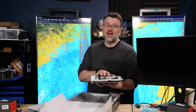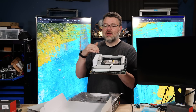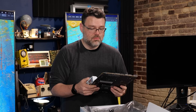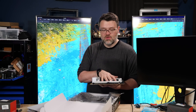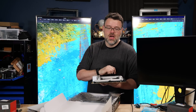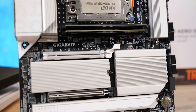For the 16 plus 8 plus 4, 105-amp power stages, we have three giant heat sinks all connected with a heat pipe in a U-shape, with a see-through sandwich design meant for airflow. I don't think you should be dumping a thousand watts into your CPU on this board like you can on the other two TRX50 motherboards. While this board has dual 8-pin power connectors, it does not have an auxiliary power input. I would not recommend a triple GPU configuration — 225 watts for three GPUs across the PCIe slots is too much; 150 is pushing it.